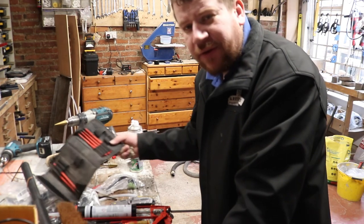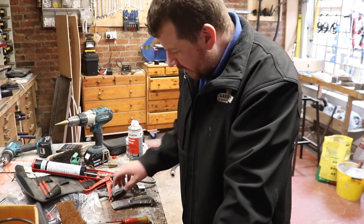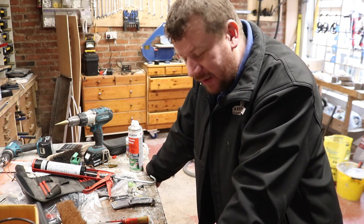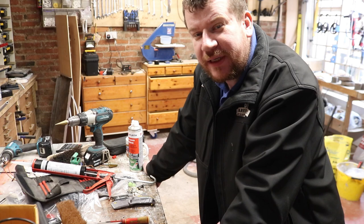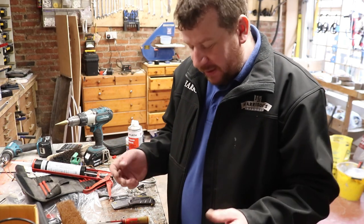It's a good job I did come in. After I'd had all the fermenters out and we painted the floor, I realized I hadn't reopened all the disconnect valves on the back, so the temperatures were climbing a little bit — into the 20–21 degrees C range. So I opened all the valves up and inspected them.